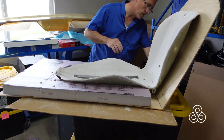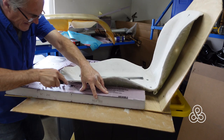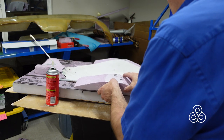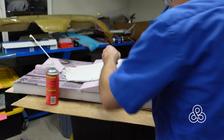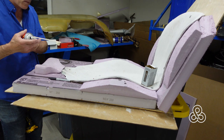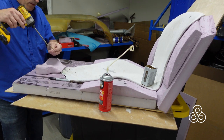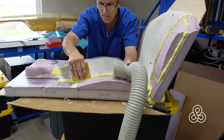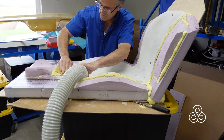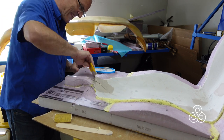We need to build up a flange around the seat as well. So while we're making the form of the seat, we're going to add some foam around it to create a flange so that we can have a mold with a flange that will be able to be used for a vacuum bag. Some sheets for the basic shape and then cut some others to come up around the curves of the edges of the seats. A little expanding poly foam and some screws will hold all that together. I've also had to create a headrest from foam — carved that with a rasp and some sandpaper. We'll bond and screw that in place, then use a little bit of expanding foam insulation to fill some of the gaps. Sand all that down, then go back to body filler to fill in all the cracks and transitions to make this thing a little more smooth and congruent.